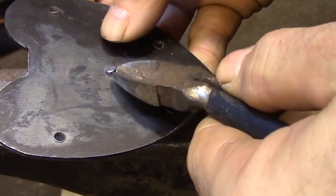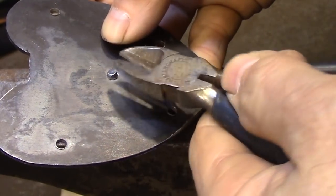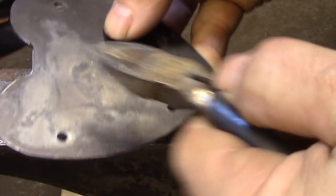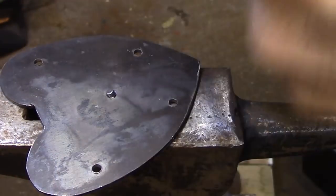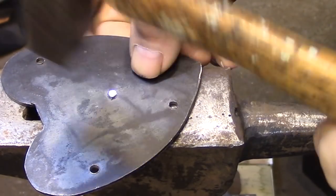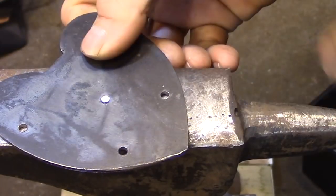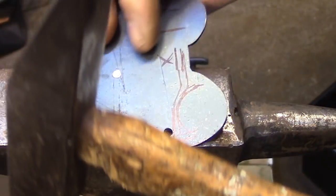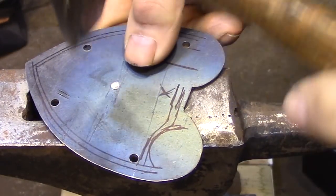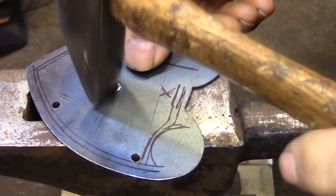It's certainly a lot less work than rebuilding two new plates. I've prepped the plate here by drilling in two counter bores on either side of the plate. They're very shallow, obviously, because I don't want to drill right through and create a new sized hole. I just want somewhere for the rivet head to go, and I'm using a really short rivet. There's no strain on this at all - I just want to fill that counter bore and make sure that the rivet doesn't pop out at some point.